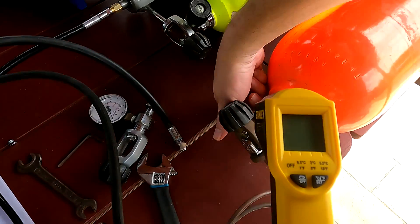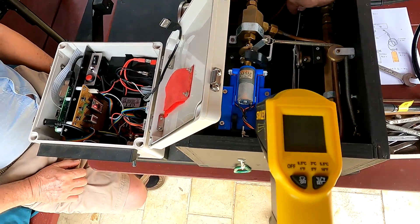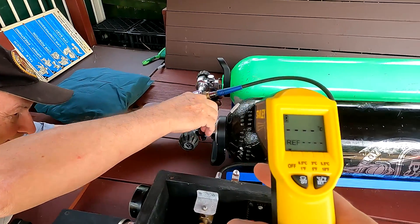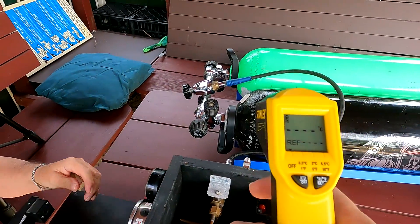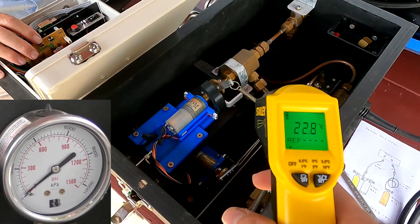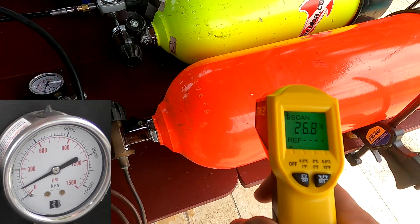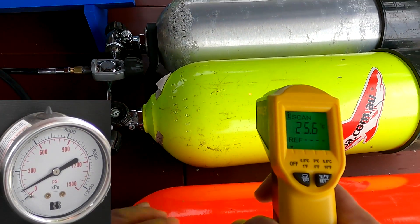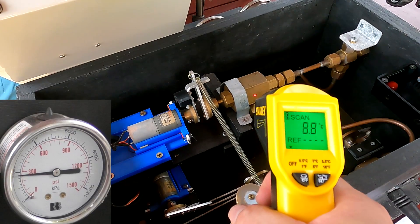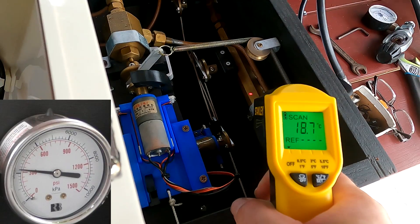I have to apologize for the background noise — there's a school close by and it was their lunch time. We have attached a temperature gauge to the GoPro so we can see the temperature at different times and places. Starting at 23 degrees on the valve and 260 bar pressure. Temperature is starting to drop as we're filling. The receiving tanks are now at 27 degrees, getting a bit warmer, while the valve reads 13.2, then 12, then 9.8 degrees. Starting to get a lot more condensation. Down to 6.6 degrees on the valve. The manifold is getting chilled at 19 degrees.